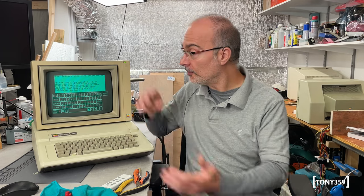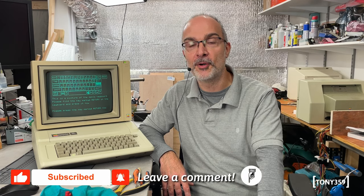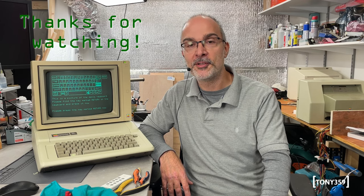We've reached the end of this video — the monitor is working and it's ready to go on display at the Museum of Computing of Swindon, not with an Apple IIe but with an Apple II Europlus, the one I fixed in a previous video. The monitor was working already, but it was still a good idea to replace those rifa capacitors, which would have exploded at some point. It was also nice to go through all the components and give the PCB a once-over to make sure everything was in order. I really hope you enjoyed this video — if you did, a thumbs up would be appreciated. Leave a comment — I try to read and reply to them all. Consider subscribing, and I hope to see you again soon. Thank you very much, have a good day, goodbye!